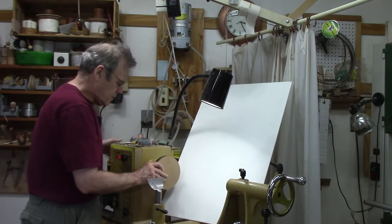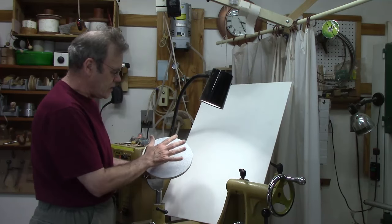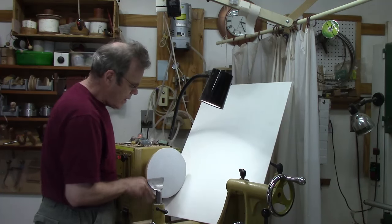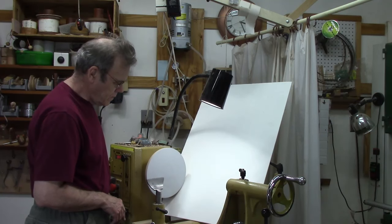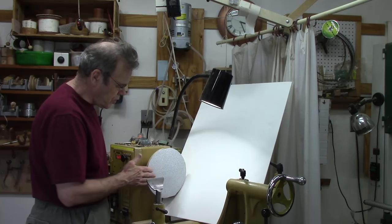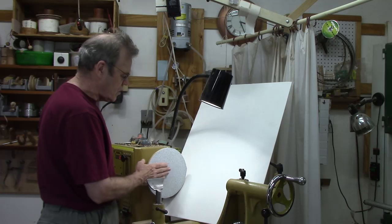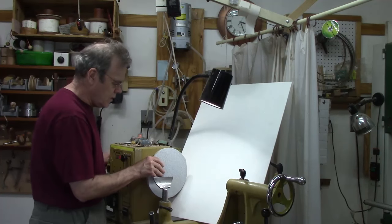A similar trick is you make one a little bit larger — I believe about nine inches — so you can glue a piece of sandpaper on there on this threaded glue block, and now you have a sanding jig that works great. This one is a little bit out of true, so you'll want to surface it with a scraper or a skew to get it perfectly flat. But if you're demoing or traveling, you can also use this in an emergency to freehand sharpen your tools using your tool rest to support them if you get in a pinch.